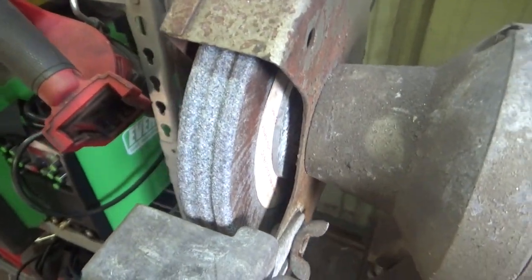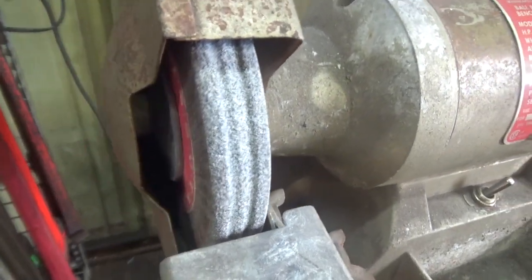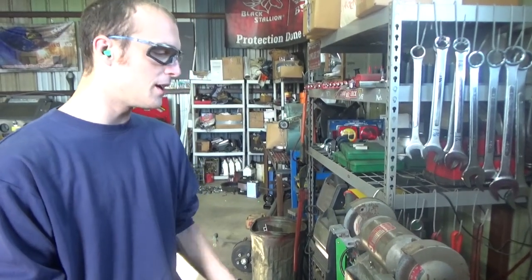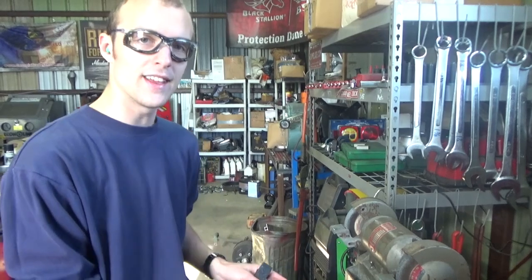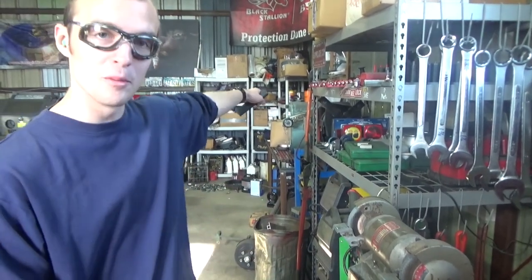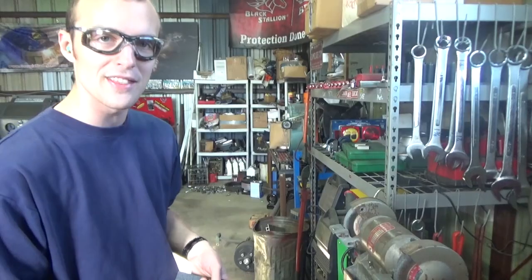That was one of my better finds. I really like this little grinder, and I've heard from a bunch of people that it's actually fairly dangerous to have grooves like this in a wheel. At this point, the grooves are so deep, usually from sharpening tungsten on this thing, that it's a little bit hard to use the grinder. Then we have the metal removal machine over there, whose grinding discs are really glazed and crapped up with material that's been there over the, I don't know, 18 months or so since we built that thing roughly.